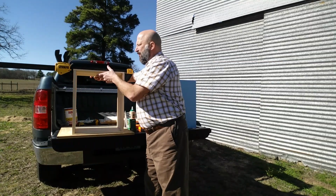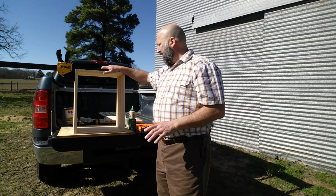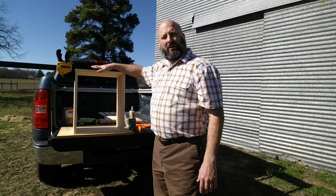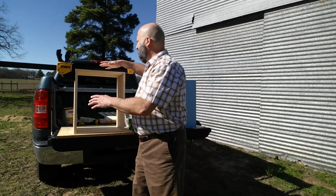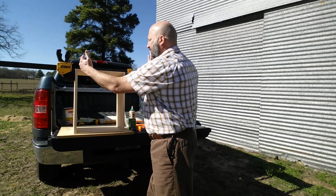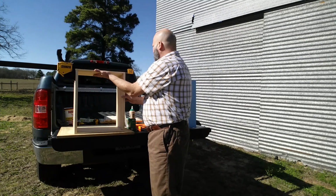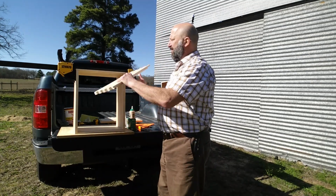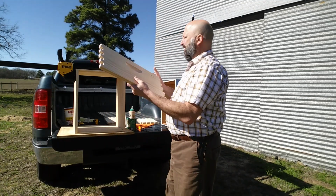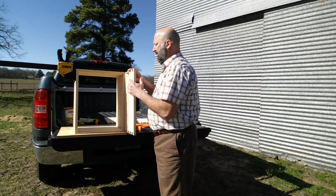Now one thing I do when I'm putting together my boxes is you don't have to do this. I like to. It makes them really nice and tight and square. I use these wood clamps, okay? And I put 2 on there and I just crank them down to draw everything together. Okay, and once I have everything drawn together, I'll take this top part off, which is this. I'll pull it off, and then I'm left with these 2 open ends setting up on each side.